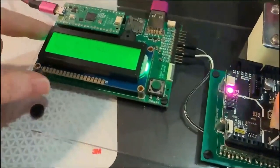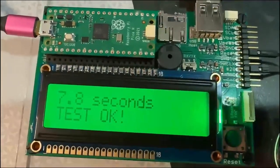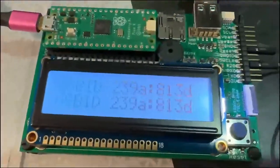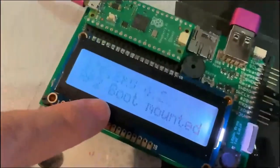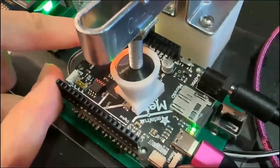I'm using my Pico-based tester to program the UF2 that gets loaded onto the Metro — it lives on the SD card. You press the button, it says it's waiting for the USB device, then it resets, copies over the UF2, tests the output, and it passes. This is now ready to go into the shop.